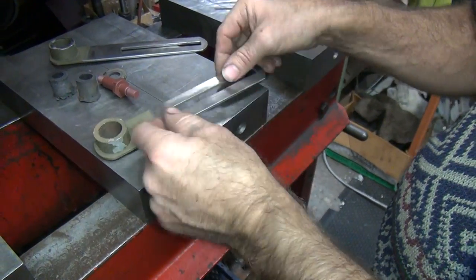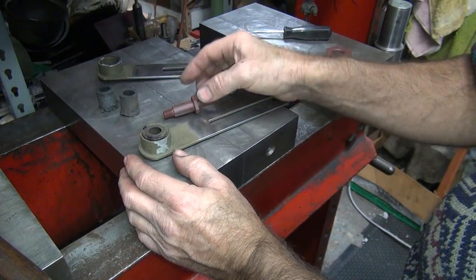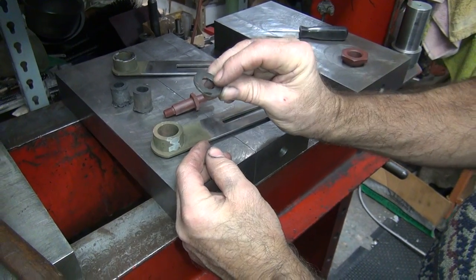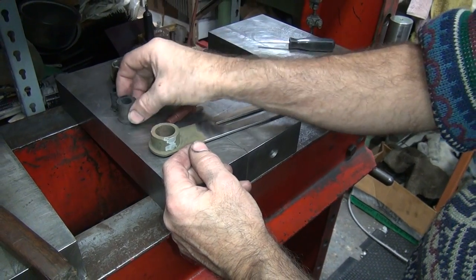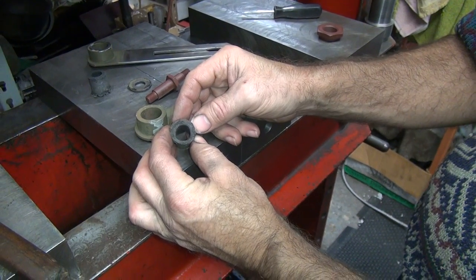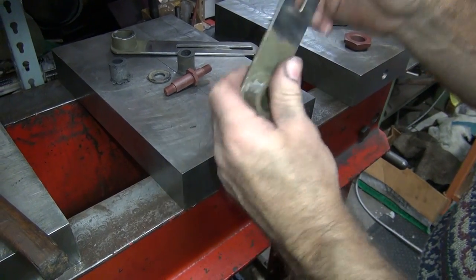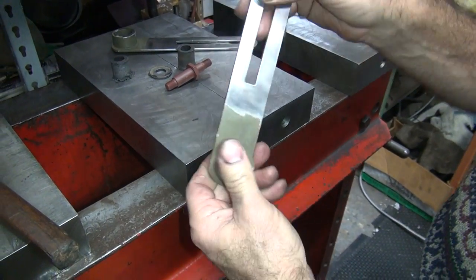All right, so they're out now, so we're going to have to make up something to go in the hole here. I'm not sure if we're supposed to have a washer here or not. Maybe. I'd have to look in the book. So we'll look in the book. If so, we have to blast this one, and then obviously we've got to get another one if it's supposed to be in there. So if we get some urethane, we can probably make a chunk of urethane. Nylon will be pretty hard. Obviously any kind of metal wouldn't give any flexibility. You've got to have some flexibility for it to go up and down and work correctly. If it was held solid here, it wouldn't be able to move in and out. Be free.